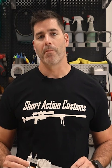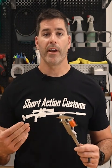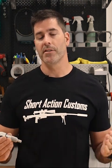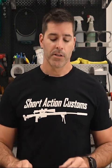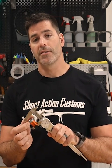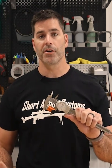One common question with our modular headspace comparator is why people get a different reading when they push really hard on the calipers versus when they use a nice, soft, gentle pressure. That's a very common thing with any precision measuring instrument. That's why on outside micrometers there's actually a little spring-loaded clutch — this helps you apply a minimal amount of pressure, which increases consistency and accuracy. When using your modular headspace comparator, you shouldn't need a lot of pressure. Simply rotate your insert in the body, your cartridge or bullet will settle in and square up, and with simple, basic pressure you should get a nice, accurate, consistent measurement.